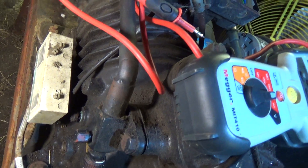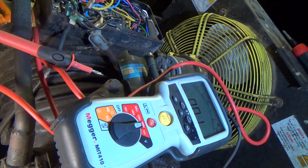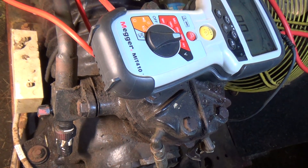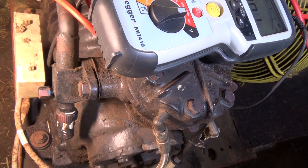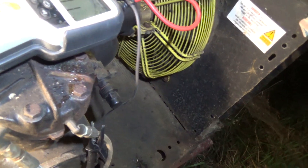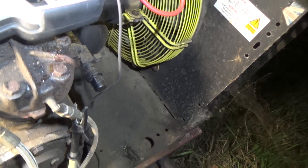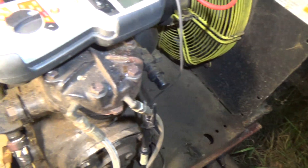We'll have to let them know and see what they want to do — whether they want to put a compressor on there. We could put a hermetic on there to match the duty; that would be the cheapest. Although I'd probably get one of these rebuilt cheaper. But then the condenser's knackered, so you'd need to put a condenser on there as well. And I expect buying a compressor and a condenser will probably cost more than buying a whole new unit.